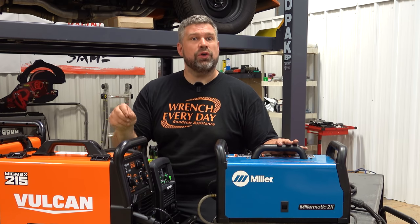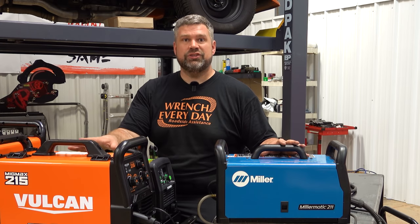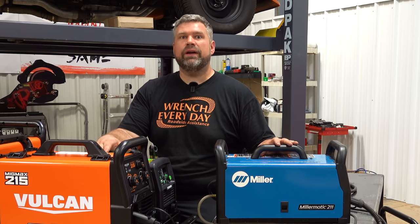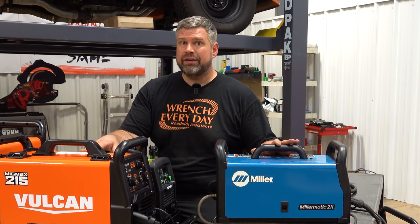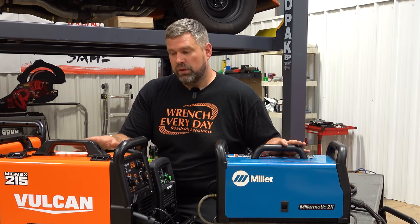The other thing is, with all of those small switches handling that high frequency change, they generate a lot of heat, but they also dissipate it very quickly by lots of airflow. These have generally very powerful fans. They move a lot of air, especially compared to a transformer machine, but that creates one other really big drawback.